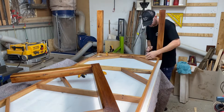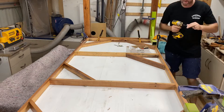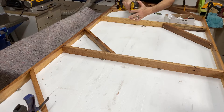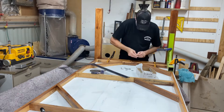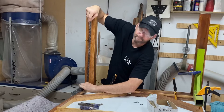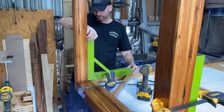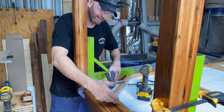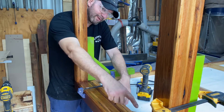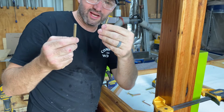The way I've designed this is so the legs will basically align themselves to be flush with the table, and then I can affix the framework with it all locked in position. A couple of screws in the middle because I know that's not going anywhere, and then attaching those figure eight screws to hold the tabletop down. These corner clamps have really helped me out to set everything perfectly square and then I can tighten up the bolts. The end ones have got a fair bit of room to move so that tabletop can do its magic. Turns out if you bought the wrong bolts, you can just cut them off.